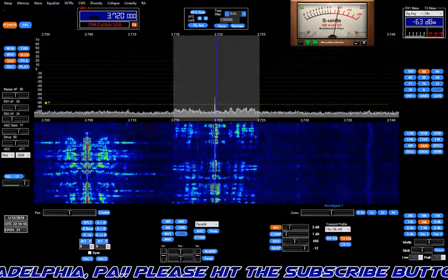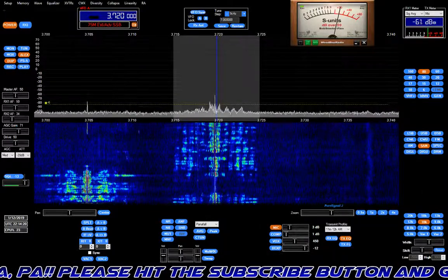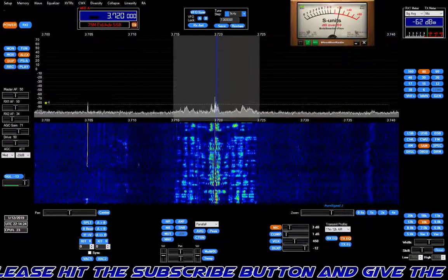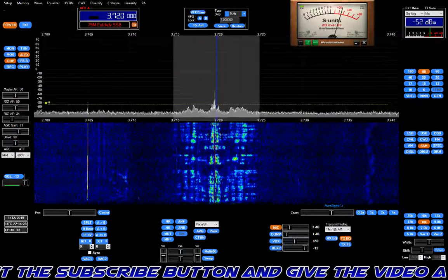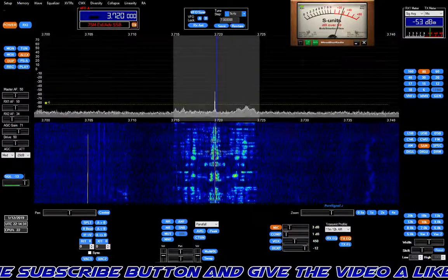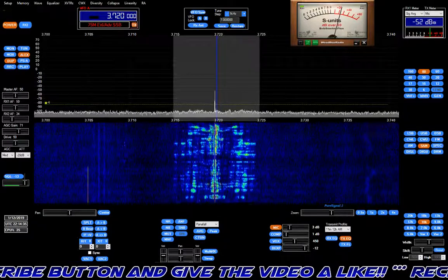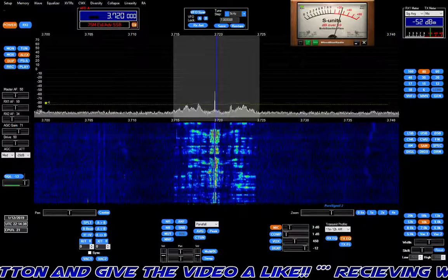I think I answered just the D104 without a preamp, a regular D104 and a regular 444. They're for vintage old radios. You need a very high impedance, like a tube input, for a D104. Same with a 444. They'll sound horrible on any modern radio, so don't even attempt to put those on a modern radio.